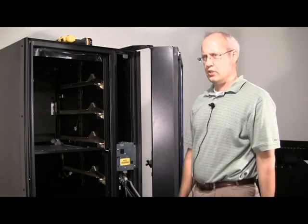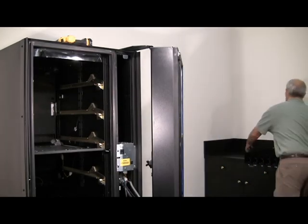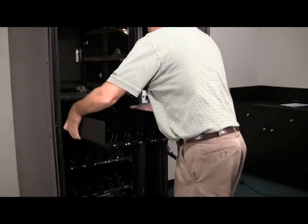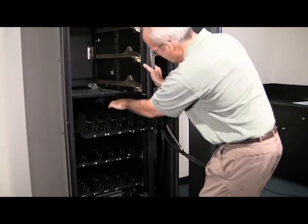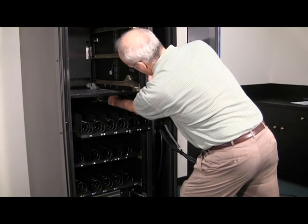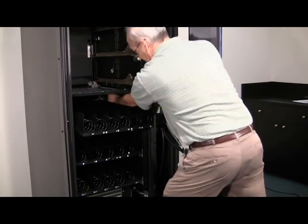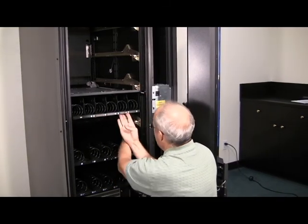Now we'll reinstall the 4 trays that we removed earlier. Start with the 4th tray that we put that air curtain on the bottom. Put the trays' wheels in the slots. Connect your tray harness and put the sheathing in the strain relief on the side to keep it out of the way. And be sure to pull down your wheel ramps so the tray doesn't fall out.